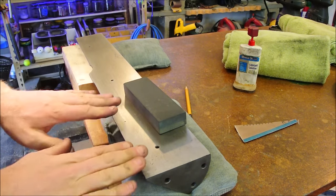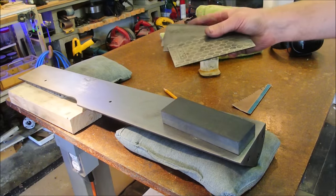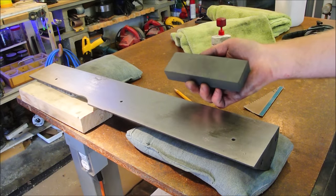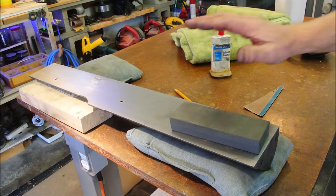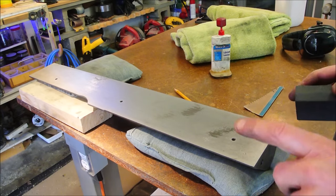The palm sanders, step one, is to get it flat in the most crude sense. But now we're going to start to get it really in plane. Everything after this is just a matter of getting the scratches out. Think of your sanding as rust removal, and then think of the stoning as turning it into a perfectly flat plane. But that perfectly flat plane will still be scratched, so later we'll have to buff all the scratches out. Stay tuned.